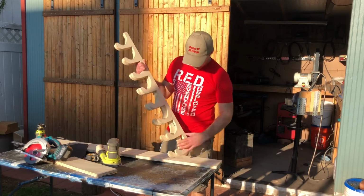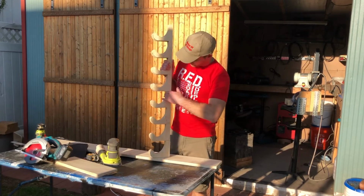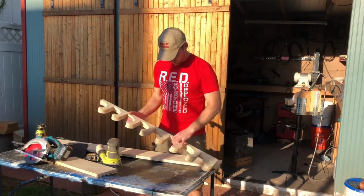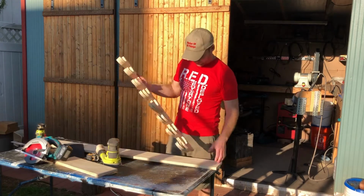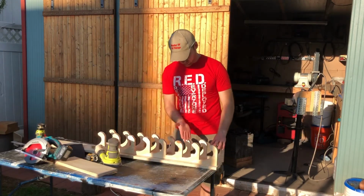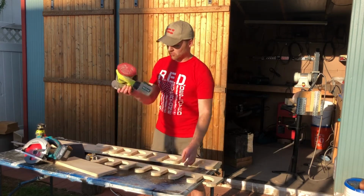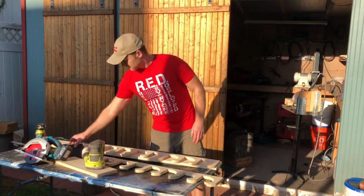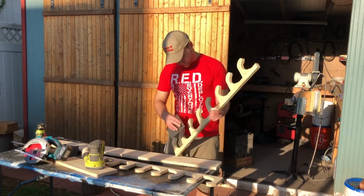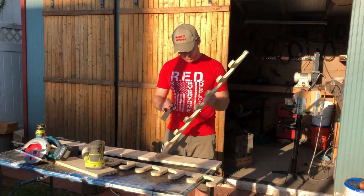And what you wanna do is compare them, make sure everything's pretty much even over here. No imperfections, and it looks pretty good. So they're technically gonna be mounted to a backboard, separated, and then the weights will go inside. First, we're gonna sand it. Use one of these to get the surface. Then by hand, we're gonna get into the corners, one by one, round everything off. Smooth it out. I'm using 220 grit, which is perfect.